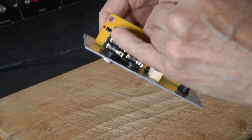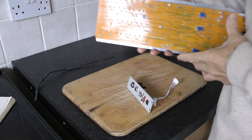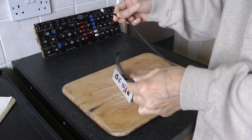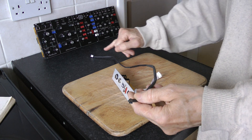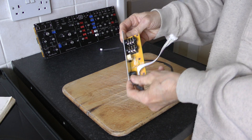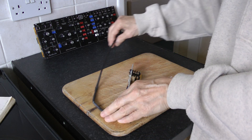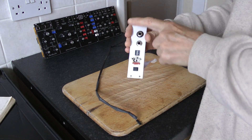The output jacks here have a speaker cable connected which runs to the Behringer on the back. You need to make a cable that runs from that part of the unit to the Behringer and extend it. I also had to get some self-adhesive screening cable, which you can get on eBay, and put it down here. I had to remove the original cable because it's soldered in, put jumpers on, and add a plug socket to plug it back in again — otherwise you'll get a humming sound from the interference of this board through to the cable.